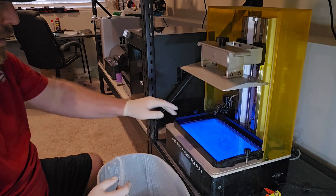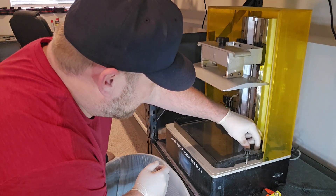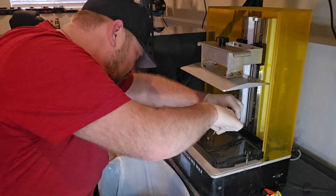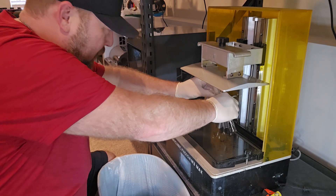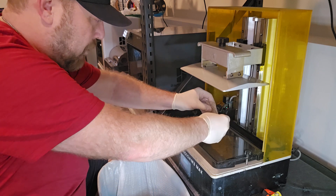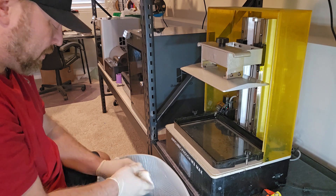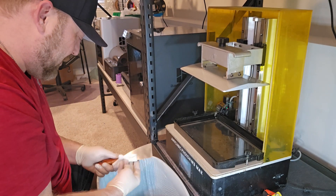What that's going to do is get all the malarkey stuck on the bottom of the plate, and it's going to come off on one layer — you can really screw up grabbing this layer. It's best to do it with no gloves on, isn't that fun? But I think I got it this time, and it just comes off. Nice, even layer. Now you have that whole bottom completely clean of any kind of plastic debris. I have a rubber silicone mat right here and always have a paper towel to get your trail cleaned up. So now what I'm going to do is just simply up my supports in my software to heavy, and then we'll see what happens.